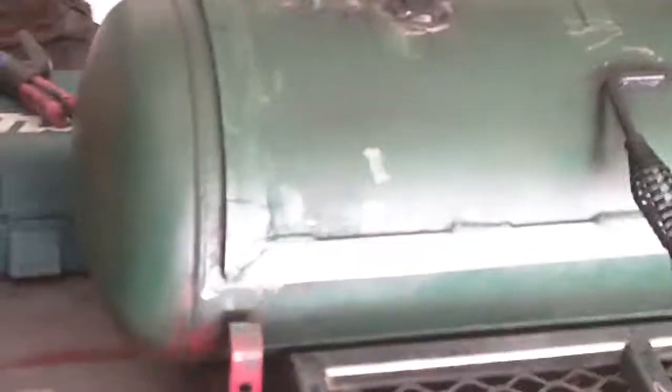Once you got that going, go ahead and close your door. Get your top bar. Depending on the weight of this door, this is not too heavy. I'll usually go an upsize, so this would be like 1.5 inches, because this is 1 or 1.25 inch tubing. It's hollow right now. What I'll do is use a piece of 1-inch flat bar stock, and I'll weld it on just before it's closed. That's just part of the finishing touches there. So they're both cut out in 45s and welded on.